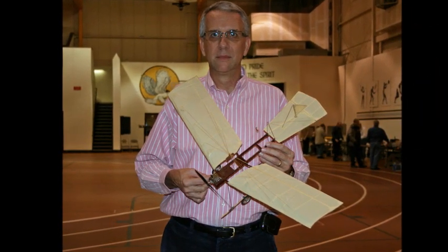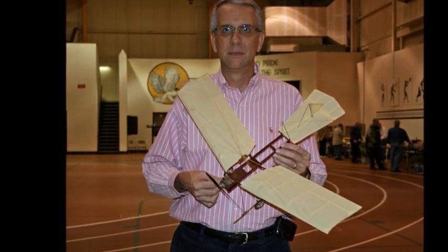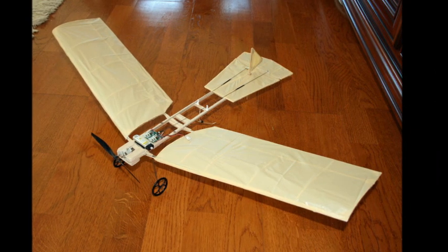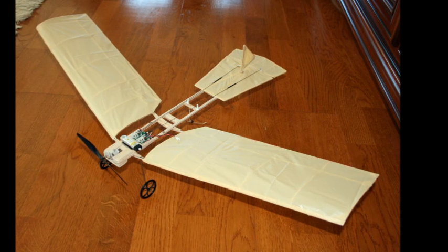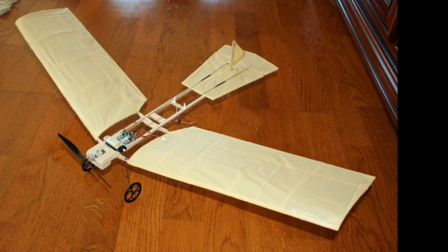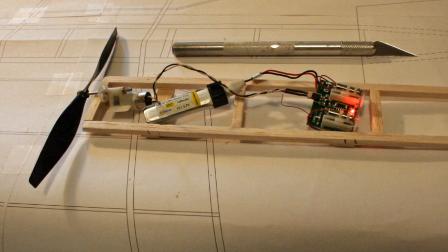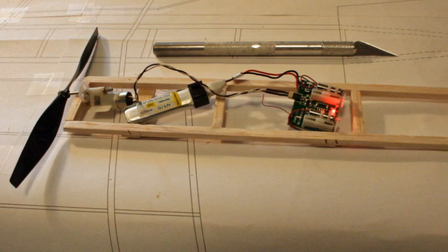The Fokker Spin was one of my most recent designs for the ultra micro series radio control equipment. The Spin is an interesting design, so I decided to do a prototype just to see how it would work out for a radio control model. Note the swept wing and the all-moving rudder. For the prototype, just to keep things simple, I mounted all the electronics on the top of the fuselage as far forward as possible to help maintain the forward center of gravity, for ease of adjustment and installation. As you design or modify aircraft, you'll have to think ahead to accommodate the radio control electronics.